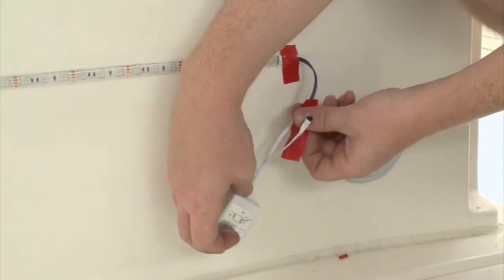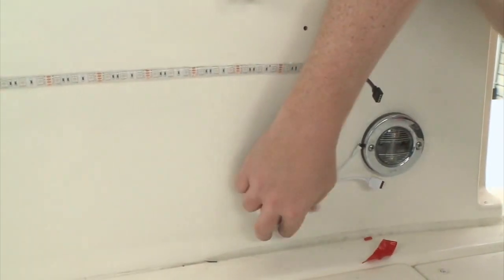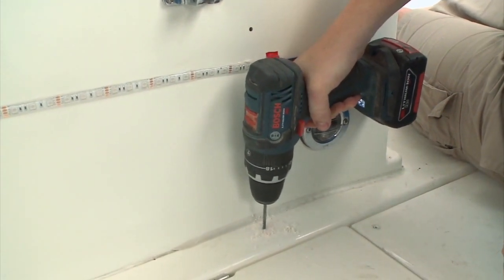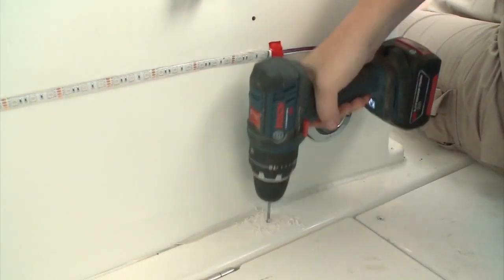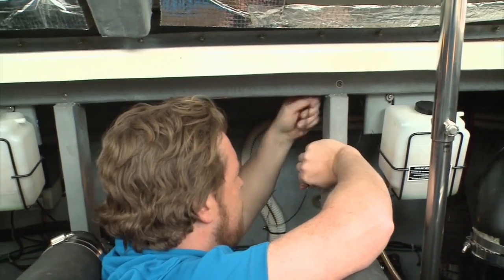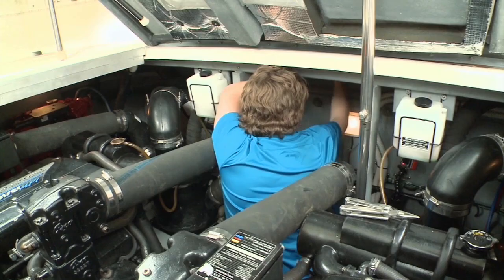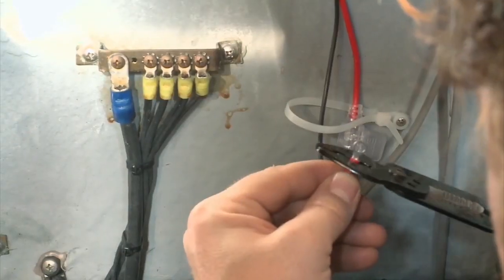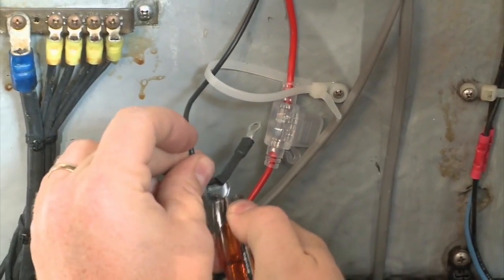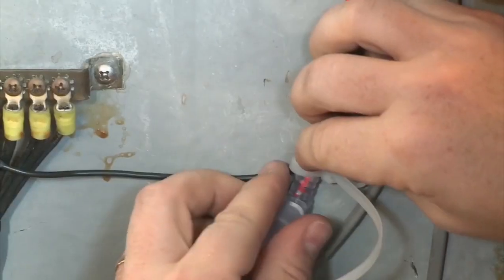First, place where you want the transformer to mount so you're not putting extra strain on the wires. In this case we're connecting it to the underwater lights, so that means drilling a hole to access those wires in the engine room, then fishing the wires through the hole. Here we have wires already running, so we can just zip tie them along the same path — which can be frustrating to reach at times, but otherwise it's straightforward. Add the terminal ring to it, crimping it tight, then use a small shrink tube to keep that sealed up watertight, and screw it into a negative bus bar to ground it.